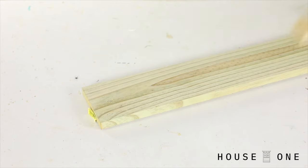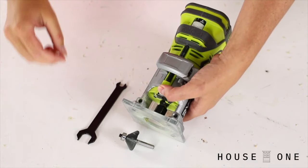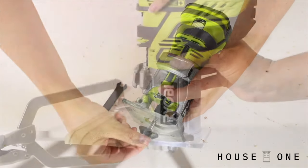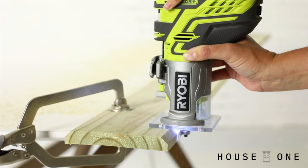To keep the cost as low as possible, I'm working with 1x6 and 2x2 pressure-treated boards. The first step is to fit a router with a chamfer bit, and then bevel the edges of all the boards except one, which will be used to create the lid.